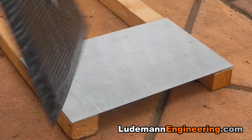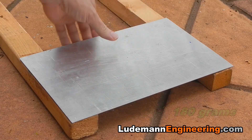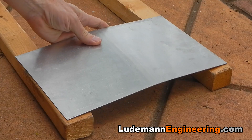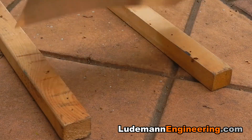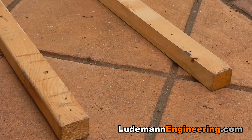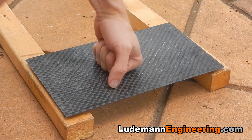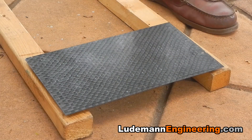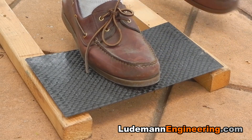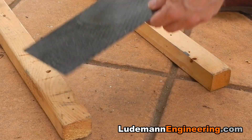So here's our beautiful sandwich panel, all nice and cute. I cut myself a piece of aluminum that's exactly the same weight as the sandwich panel. You can see how stiff it is versus how weak the aluminum is — I can bend the aluminum with my thumb, probably with my pinky; it takes about two fingers to bend it. But I'm going to put our sandwich panel on here. Obviously you can't hurt it with a couple of fingers. There's a little bit of cracking noise. I'm pressing at about 175 pounds.